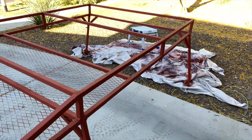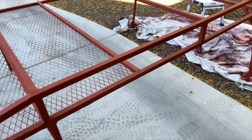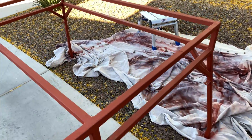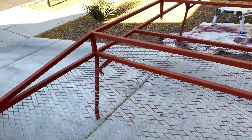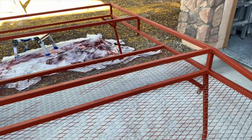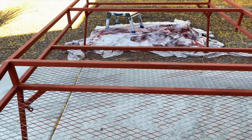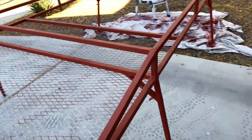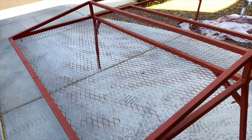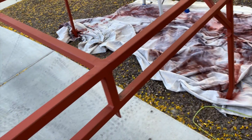Painting over rusty metal is always kind of rough, so first I'm going to use this filler product to hopefully fill in some of the pitting that I've sanded over. I finished the first coat and I'm going to do one more coat, then go with normal spray primer and then the $4.50 O'Reilly gloss black. This is going to get beat up pretty bad over time, so I'm not super worried that it matches the truck exactly — I'm not going to go full automotive paint on it, but so far I think it's looking pretty good.